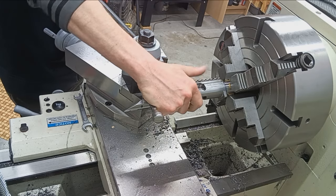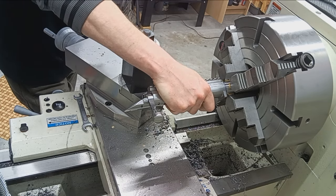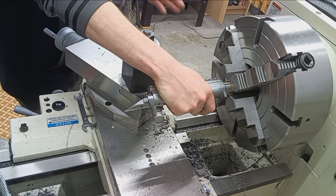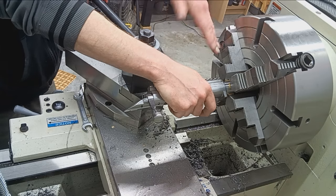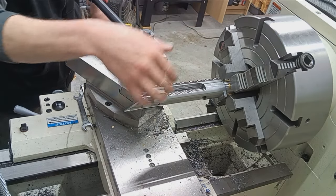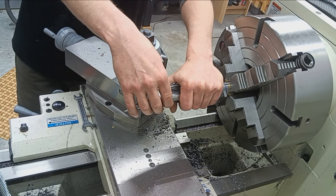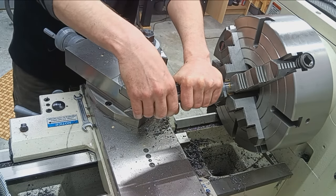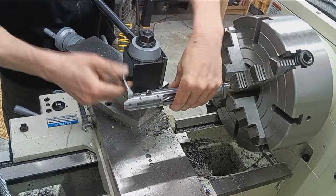So next thing in the order of operations is going to be the chamber work. So we, as always, pre-drill. In fact, back up, so we'll check alignment, adjust if necessary, pre-drill, bore. I'm going to have to get a new boring tool, of course, but bore it, and then use the chambering reamer to finish the chamber. So we're going to have to change setups again and whatnot, and I think I got to go do some running around, so I might just wrap this up for today and do the rest of this tomorrow. Kind of depends on what time it is, so I'll check the time and all that stuff. So regardless, we'll be back for the chamber work.